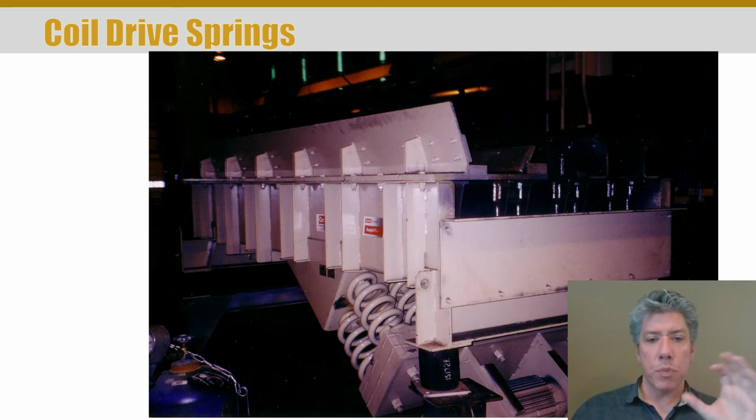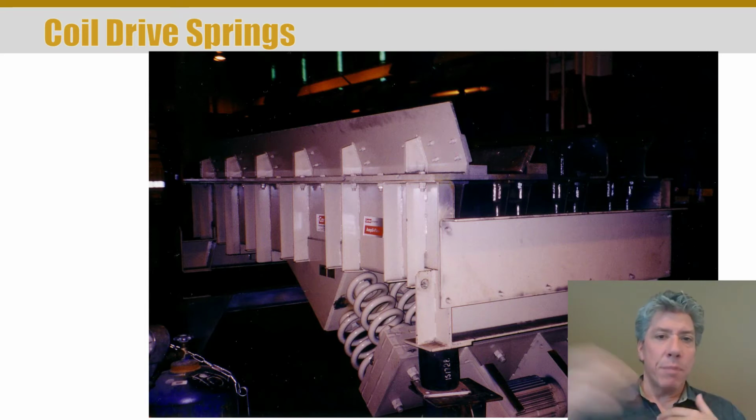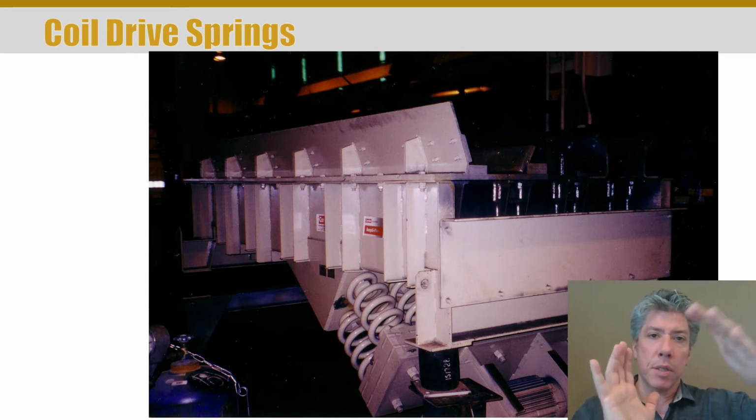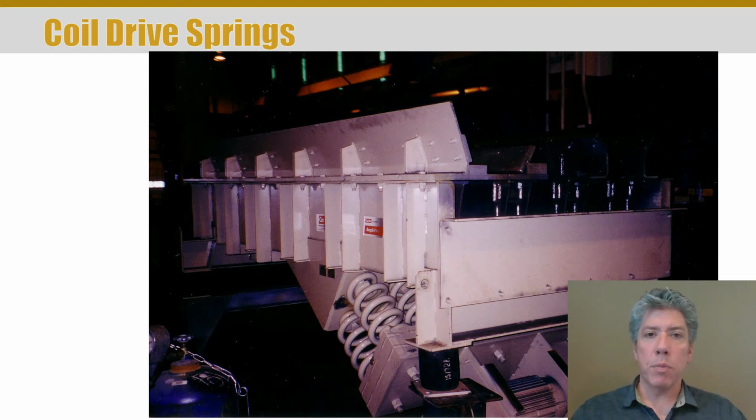The interesting thing about springs is you can classify them in a way based on how reversible they are. That's a term from thermodynamics, and what it really is talking about is, do you get out of it as much as you put into it? If I take a metal spring and I compress it and I plot force versus position, it turns out that I'll actually have to apply a little more force as I compress the spring than I get back as I expand the spring. That's because some of the energy that goes into the spring does some things like warming up the spring material, or maybe a few bonds have been broken, or maybe some grain boundaries have been moved within the spring. But some of the energy is lost.